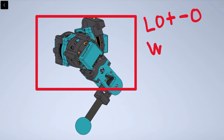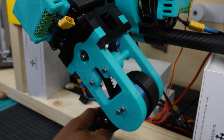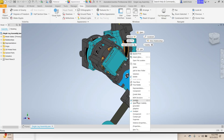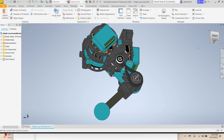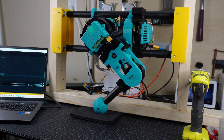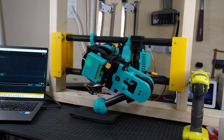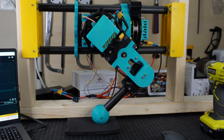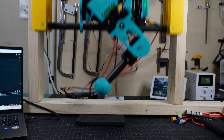This happened because one of the belts on the knee actuator wasn't tensioned enough. The knee actuator actually carries the most load, so its belts have to be really — and I mean really — tensioned. Luckily, this was an easy fix. I just added a second idler pulley to the design and reprinted some of the parts. Now it's able to go up and down. If we increase the speed of the sequence, we start to get a bounce, and increasing it further, we get our jump.